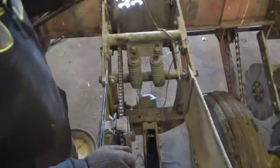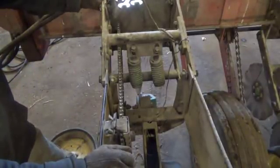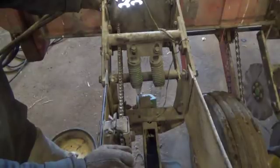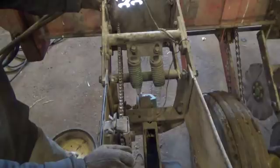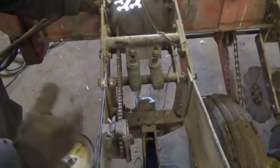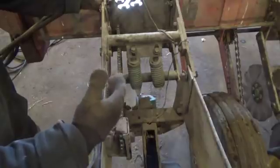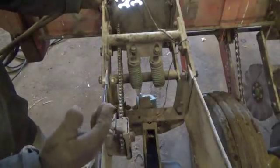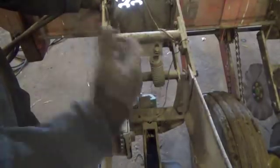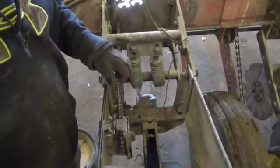Now, we didn't find anything wrong with the seed meters yesterday when we inspected them. And someone brought up a valid point that it could be a chain that's bad, which makes a lot of sense because my skip isn't a continuous skip close together. You'll see there's about 6-8 feet, then they'll miss like a foot, approximately. Then they'll be good for 6-8 feet, and then it'll miss about a foot, which would make sense that it might be a bad spot in the chain.